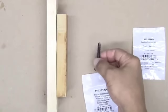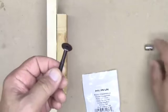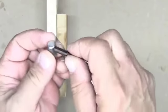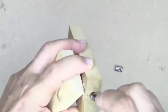Now here's a connecting bolt. This one's 50 millimeters long, but I realize now that the 40 millimeter size is better. It's available too, and it also screws right into the 1/4 by 20 cross dowel. Now in this demonstration piece, the vertical part is one of the side panels, and the horizontal part is the front panel. To let the connecting bolt go through, I drilled a 1/4 inch hole and wiggled the bit around a little bit to make a clearance hole. But if you have it, you could also use a 9/32 inch bit.